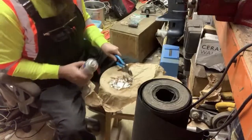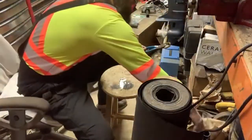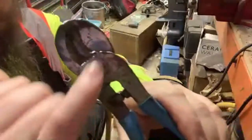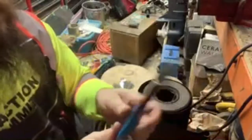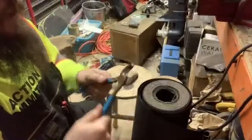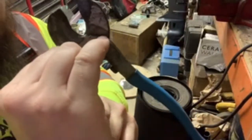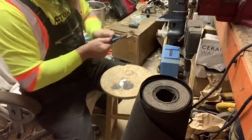I want to show you what this actually does here. You can actually see two different colors now. This surface here is a different color than the shiny bit or the rusty bit. It used to be rusty, but now because the valve grinding compound has been dragging on that surface, it's changed that surface forever. Same on this side. You can see here on that surface, it's actually ground a little smooth, quite a bit smoother than I expected it.